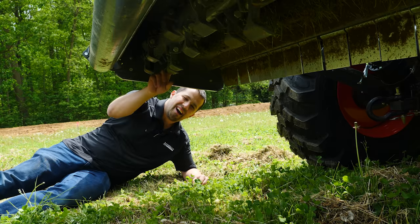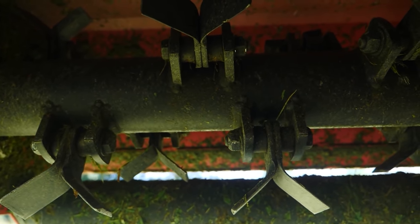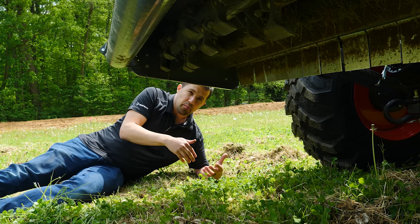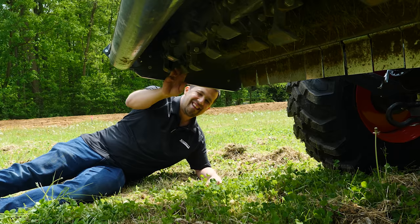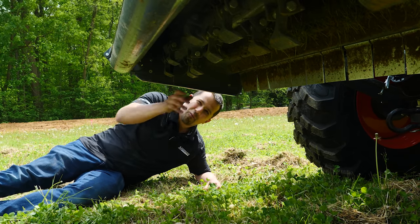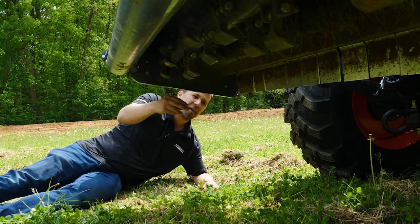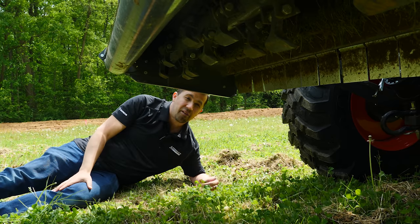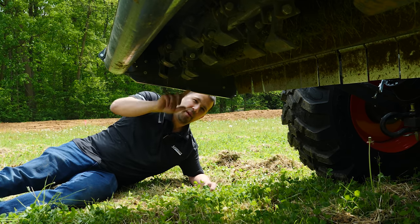You can choose on a mower like this what kind of knife is on the rotating drum on the bottom. You're usually going to have the option between a Y-blade — kind of called a grass knife — or a hammer like this. The hammer is going to have a little bit more mass and do better chopping up wood and that kind of stuff. If you're running over woody and brushy material, the Y-knives tend to do a little bit better in grassy conditions and cut the grass more finely. That's not to say that these hammers can't cut grass — they certainly can, despite the fact that there's nothing sharp about them at all. They do a pretty nice job out here today. If you knock these into the dirt, it's not like you're going to dull them. Things that are sharp tend to dull right away in dirt. These hammers seem to be a pretty good solution. If you're purely in grass you might want a Y-knife, but a lot of times people are choosing the hammer option.